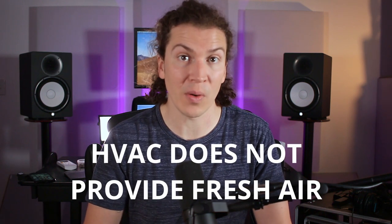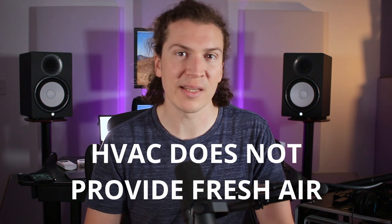A very big misconception that many of you may have is: what about a mini split or my HVAC system — isn't that bringing fresh air into my studio? The answer is no. An HVAC system is essentially a self-contained unit. It's bringing in air that's in your house, cooling it down, and then running it through the condenser outside and sending it all back in. The basic understanding is that there is not a fresh air handler bringing in fresh air from the outside, as much as it seems like that with all the massive ductwork in your home. So we must think about ventilation separately.